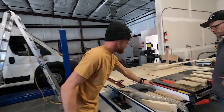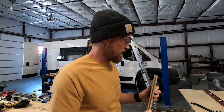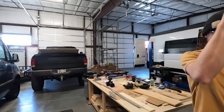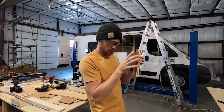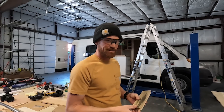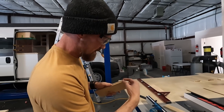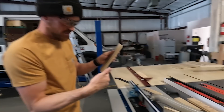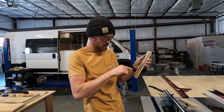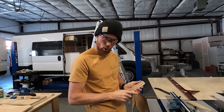These are basically one piece of the four sides of one of the doors we're making right now. We've used the router to make these grooves in every piece, and then our quarter-inch plywood over there is going to be cut to the shape of the door and fit into these grooves. Everything's going to get glued together. You're just making tongue and groove — that's exactly what we're doing. Now we have to line up the router perfectly to turn each end of these side pieces into a groove that fits into that slot. The top and bottom piece have a tongue that fits into the groove. You put a little bit of glue on everything, compress it together with some clamps, and bada bing, bada boom — you're ready to go.